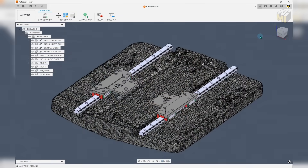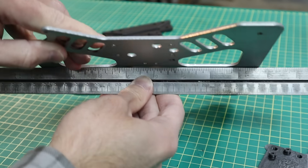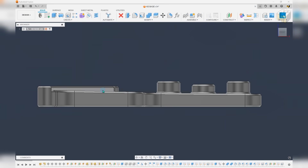To attach the punched steel support plate to the linear rail carriages, I've created printed adapter plates to expand the width just enough. I've gone to the smaller carriages because they're less massive, and having four total spread apart is better than having two just in the center. I noticed that the steel frame below the aluminum bed is dome-shaped, likely because it was stamped. So to get maximum contact surface and ensure the four mounting points stay close to parallel with the frame, I have also domed those adapter plates. If yours is not domed, please let me know — for now I'm going to assume they're all alike.